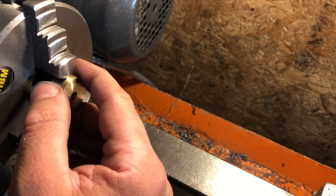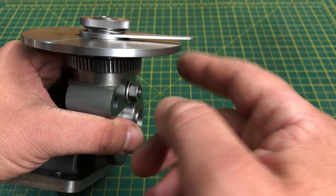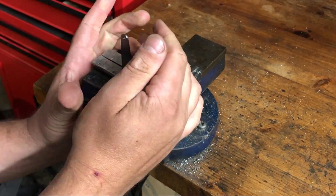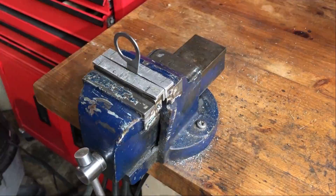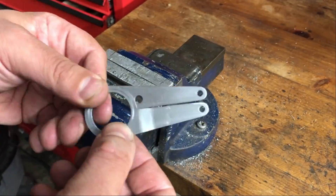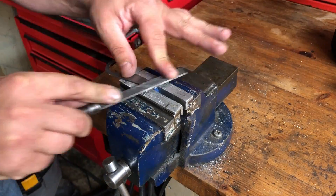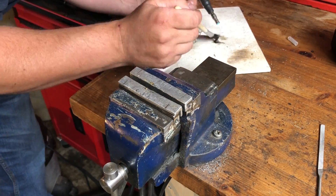With that done it is over to the bench for some assembly work. The top sector arm needs a step forming in it to bring the finger down to the surface of the division plate. I briefly considered making a former for this, and then settled on bending it by hand in the vice. The bend points are marked on the material and setting the finger squarish by eye I'm pulling the first bend, before flipping the part and encouraging the second bend to start at the jaws with a softened length of brass. A couple of adjustments and we have an acceptable result. Next a shallow countersink is formed in the back of the fingers and the shafts of the ball handles are peened into place. With the ball handles protected from the vice jaws the backs can then be filed flat, and completely unnecessarily I'm filling the remaining countersink with soft solder.